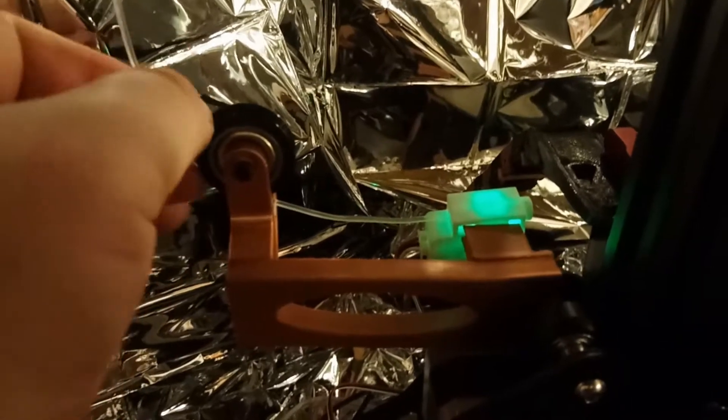This particular run-out sensor has a little LED in it to show that it is loading correctly, then I'll push it through to the extruder. I barely pinched the extruder tension knob to feed my filament in, got it just enough, and moved my little Yoda out of the way to get it barely starting into the bowden tube. I do this to reduce the risk of pushing the z-rod down.